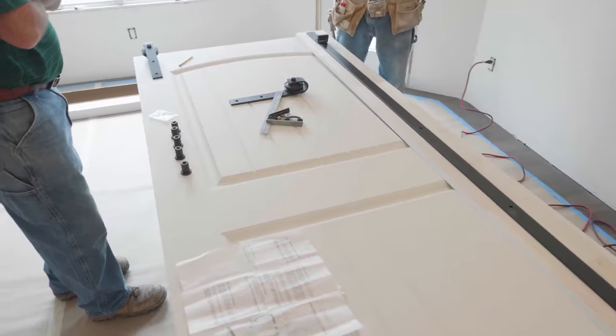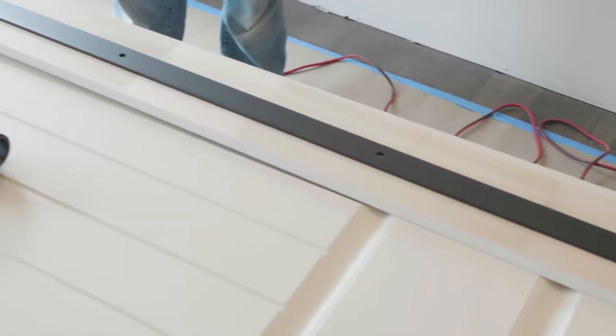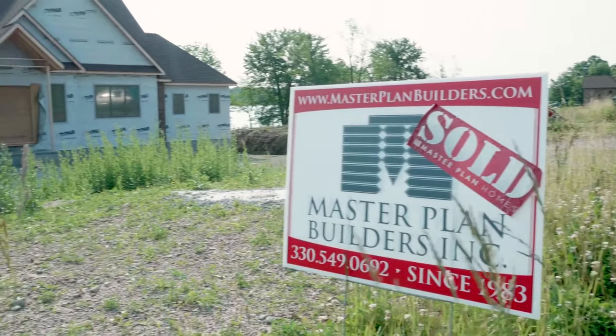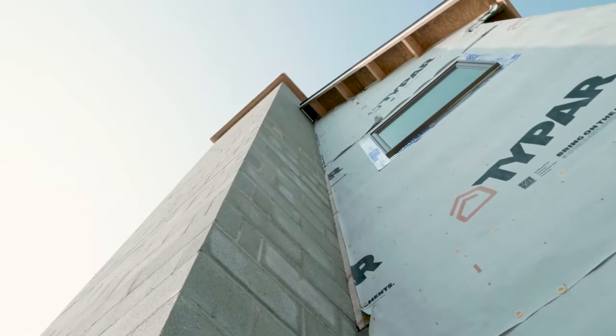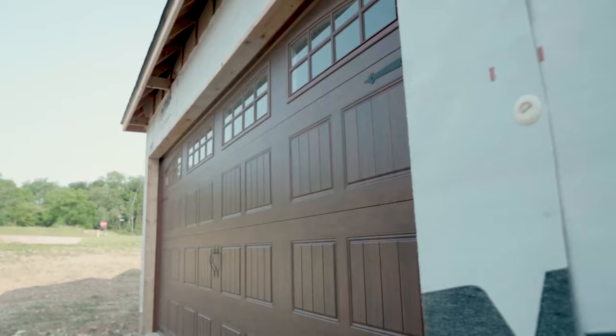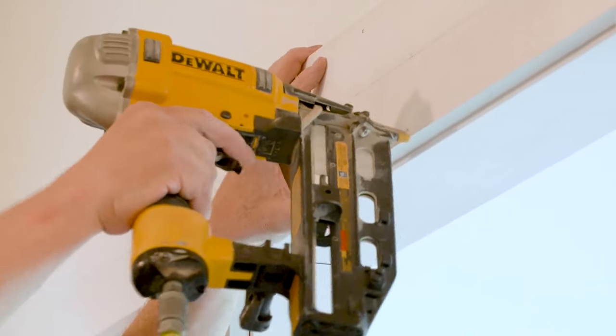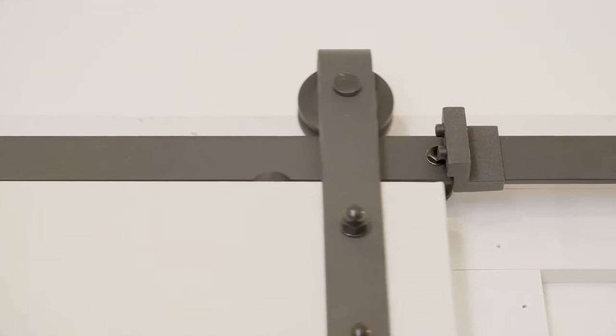When we were putting this together, we used a door that came from Baird's to match the interior doors we have here. Some barn doors can get very, very heavy, so it has to be mounted onto some solid backing before you can hang it. We were afforded the luxury today of being in a new construction job site, working with a somewhat standard rough opening, and then we dialed it in and framed the finish jamb to accommodate a standard door.